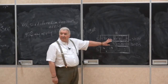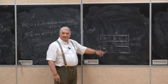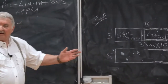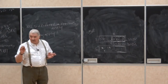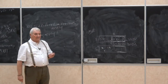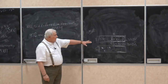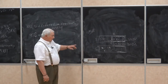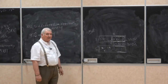Here again, there is the wane limitation on the better face. You're allowed half the length on either edge. Here's a what-if: what if the wane exceeded one-third the width? It's only 5 inches wide. That one-third width wane limitation only applies to the FAS and one common side of 4 and 5 inch wide select, paragraph 69. Even though you have a 5 inch wide FAS, it's like we talked about with the sap birch and the sap hard maple. Once you have FAS yield, it's just half the length on either edge, not to exceed half the length on either edge of the piece.